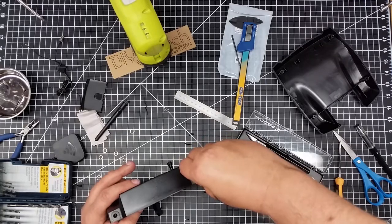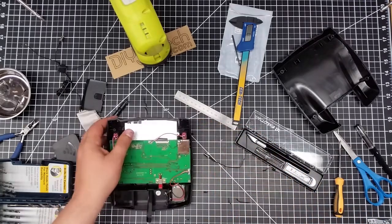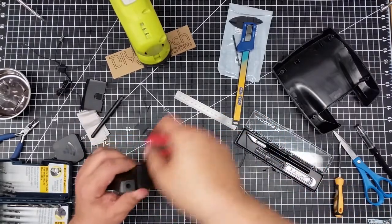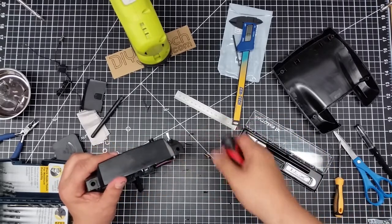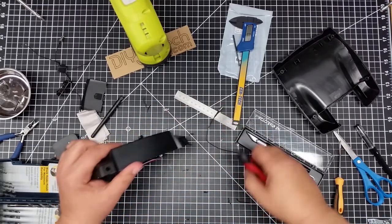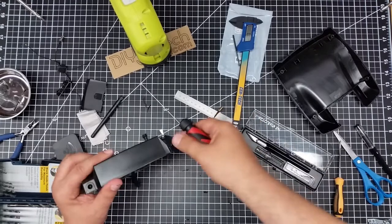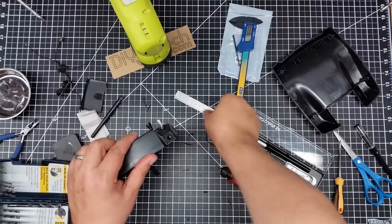This fits a little bit snug. I'm going to get my deburring tool for this one. This deburring tool is a great tool for stuff like this — I'll put the link down below. You just spin it in the hole and it cleans up the hole and also enlarges it. I'm going to use this to get to my exact hole size because I want these to be tight in there. I do not like my antenna connectors to be loose.